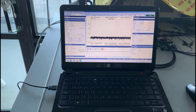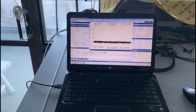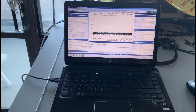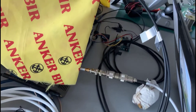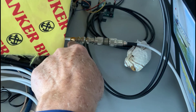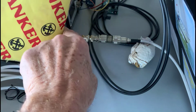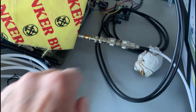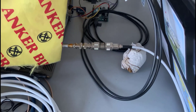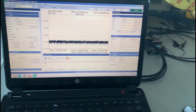In the blog post I did some calculations on what the received signal level of the GPS signal is, and I think it's around minus 127 dBm, so you can see it's below noise level. Using the VHF antenna we're not going to see any GPS signal. That little connector assembly of SMAs, BNCs, and PL-259s is how I get into the spectrum analyzer. I'm using a Signal Hound spectrum analyzer. I've got a DC block in here just in case, because later on we're going to put the active antenna on which has 3 volts on the center conductor.